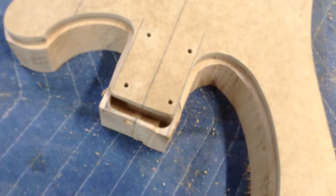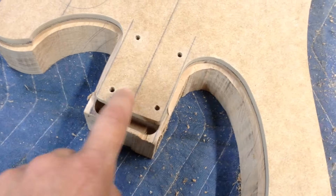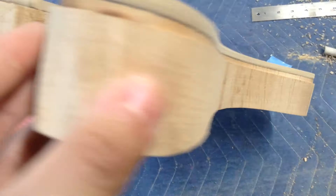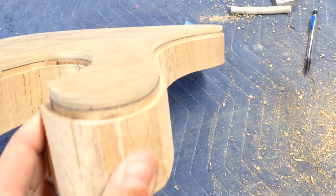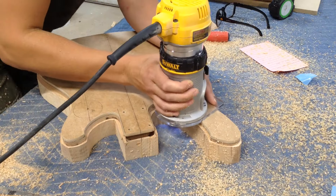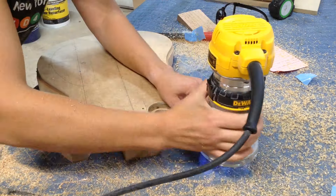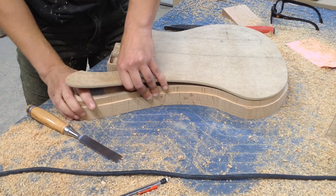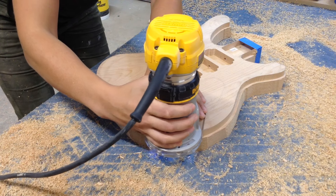As you can see, that bearing is going to follow this perfectly and match that pattern. He had told me that his MDF cutout wasn't perfect so it doesn't go all the way up the neck — you can see I'm leaving that area to deal with later, because it would cut too far into the blank if I followed what he had provided. I think it should have been about a half inch taller. Some people go through and remove a ton of material at once, but I like to make really light passes. I don't go more than about a quarter inch at a time.